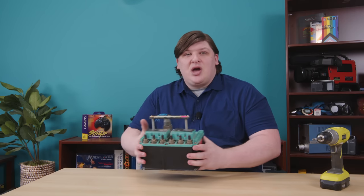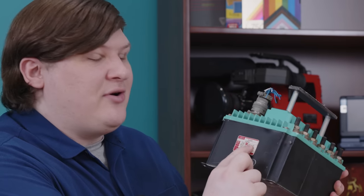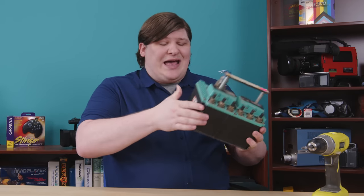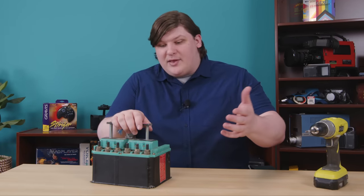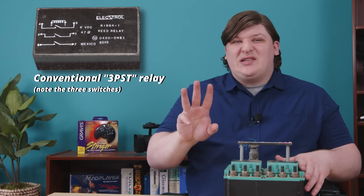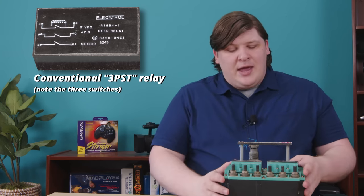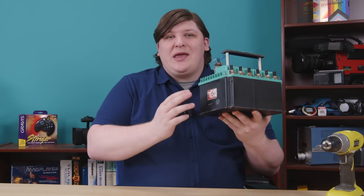It is pretty sizable as relays go. From the specs, it can switch up to 350 amps at 450 volts — that's about 150 kilowatts if I did my math right. It's also rated for 400 hertz power, which is typically used in aviation and apparently sometimes naval vessels. I'm just guessing it was a ship because of the color scheme. This is a three-pole relay, single throw, which means it contains three separate switches that all actuate at once, and they only turn on and off. The coil voltage — what you apply to the electromagnet inside that pulls the contacts together — is 28 volts DC.